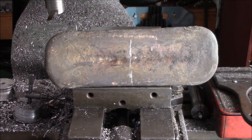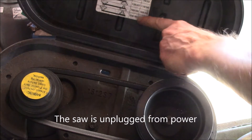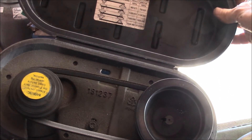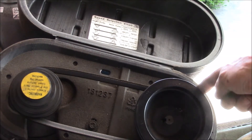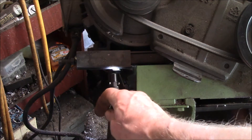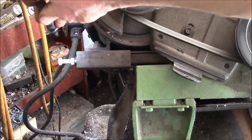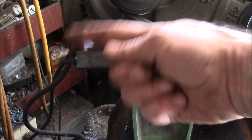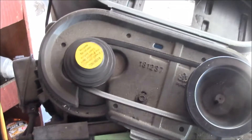I've got to put this blade in the saw and then slow the saw speed down. I've been running my 7 by 12 band saw on the highest speed — 255 feet per minute or 78 meters per minute. What I need to do is bump it to the small motor pulley and the large drive pulley. To loosen up the pulleys there are two nuts down there, one on each side of the motor, and over here is a jack screw. You loosen the jam nut, wind the bolt out, and then you can tap the slide in to loosen the tension on the pulley.